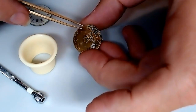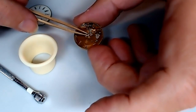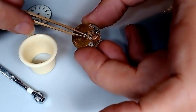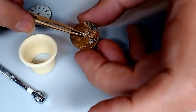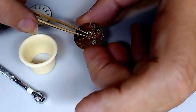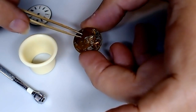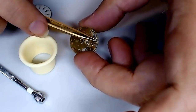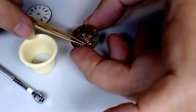I've got the cannon pinion here that I've got to remove. With my luck it's a smooth cannon pinion, which are way more difficult to remove than the ones that have a little groove in them — these are a bit of a pain. I've just got to watch for any washers that could cause an issue. I'm also going to look at the winding mechanism, which looks like it's got a little bit of corrosion in there.